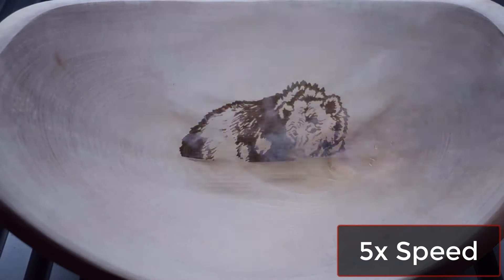On our third test, we lowered the resolution some and also increased the engraving speed setting. We then enlarged the image to fit the bowls better. The results of this third test were very good with clear details and good contrast. We decided to continue engraving the remaining bowls with the same setup and laser settings, only adjusting the size of the image depending on the bowl being engraved. Each result took between 40 seconds to just over two minutes, depending on which image was engraved and its size.